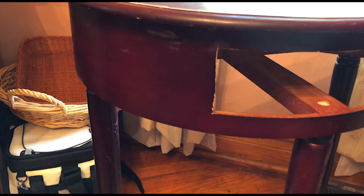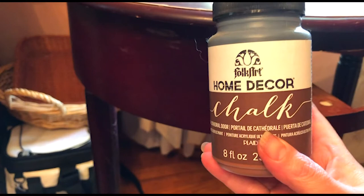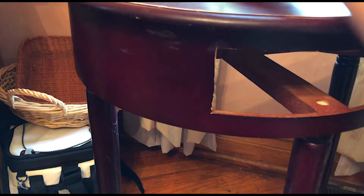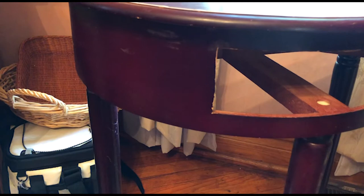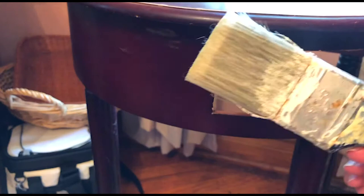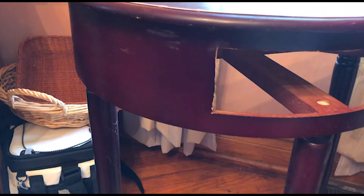Chalk painting is super easy. I use a home decor brand — chalk paint has plaster and paint mixed together and is self-leveling, so you don't have to prep or prime. It does take a couple of coats; on the top where we did a lot of sanding we'll probably need three coats, but that's what makes it so easy. I've chalk painted a mirror, a nine-dollar nightstand, and lots of other things. I have a little cup with chalk paint and just a bit of water to loosen it up, and a two-dollar chip brush.